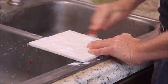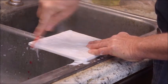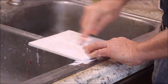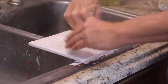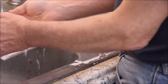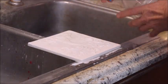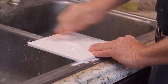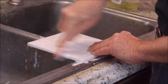I spray all of my molds with the boron nitride trying to get anywhere the glass might lap, because with me it will lap — it will slide on its own, has a mind of its own, and sometimes it just oozes where it's not supposed to. So we've applied a heavy-strength cleaner — in this case Mean Green — followed by diluted detergent, and we just continue to scrub. All in all, I would do this six or eight times.